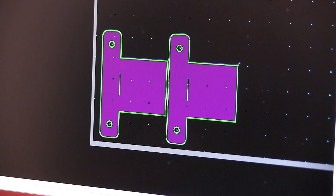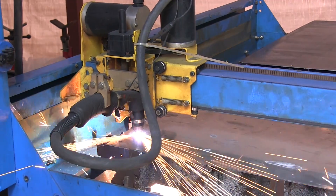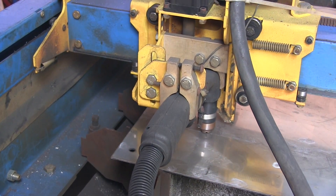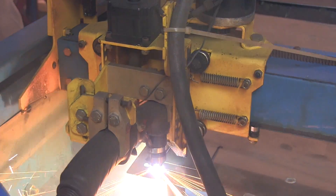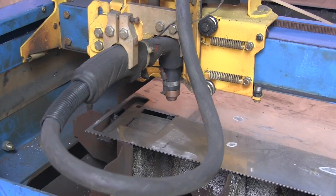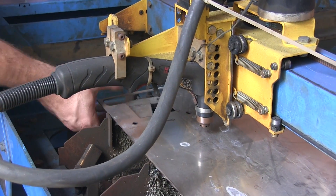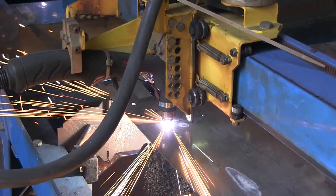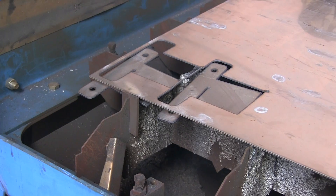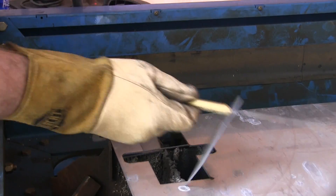Very simple little brackets. The vertical line is just to make it really easy to bend over — a little L in the bracket. They're thinner than the material on the manifold, which is by design so that they're able to flex a little bit for installation; you can make up an eighth of an inch or a quarter inch, no problem on site. Just two of these little things — a very simple little part, but it wouldn't be nearly as simple if you didn't have a plasma cam. And if anybody with a plasma cam needs an ice pick, a Duresta ice pick — JD and I both have one. They're really handy, especially for picking up hot parts and things like that.